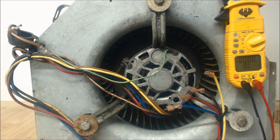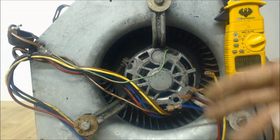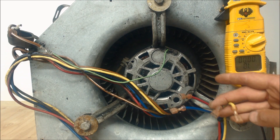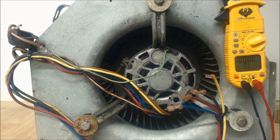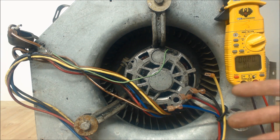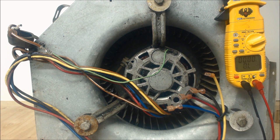There could be dust on the side of the evaporator coil — maybe somebody wasn't changing the filter or there was no filter for a while. Something in the ductwork could be stopping or slowing the airflow down, and it may not be that the motor is the problem. So even if you power it at its highest fan speed and it's not pushing the air you want, start looking at the duct distribution system and seeing where the air might be blocked — maybe the return grille is too small, or somewhere in the ductwork. Well, I hope you enjoyed this and we'll see you next time at AC Service Tech Channel.